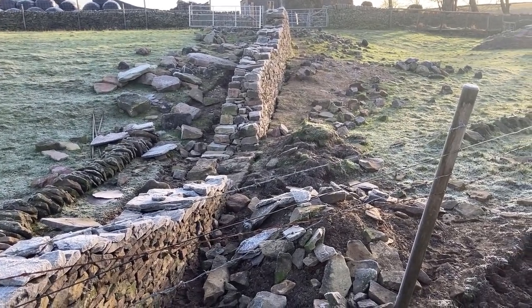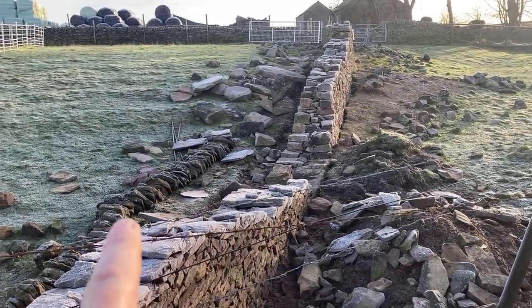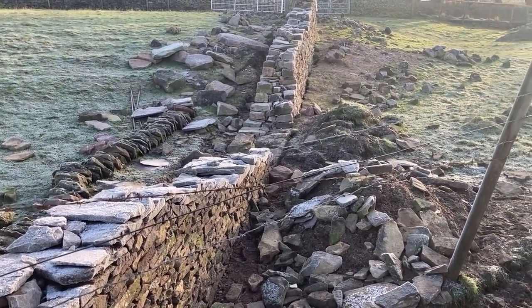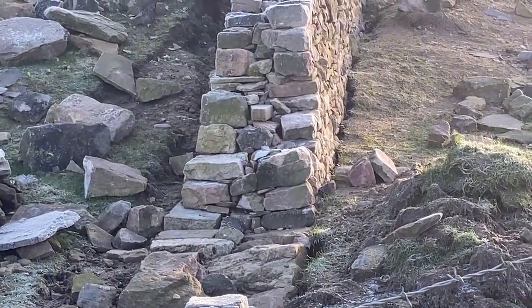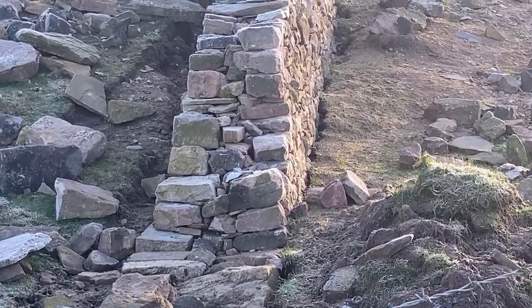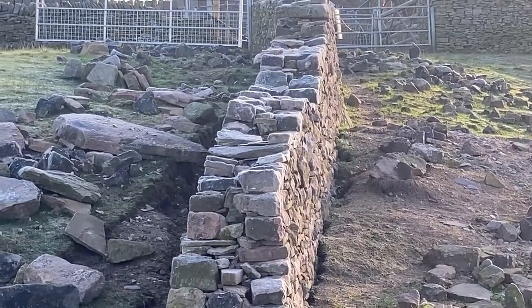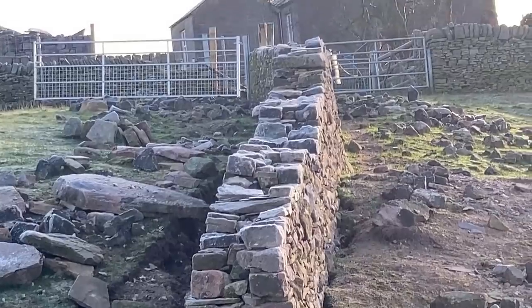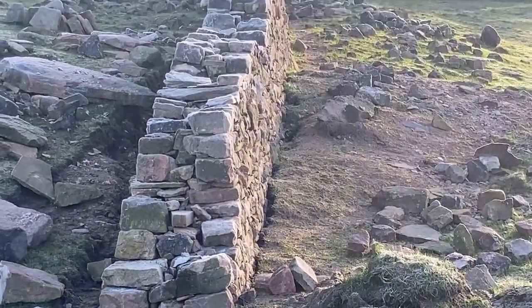That's probably a slightly better example of a dry stone wall being built. So you see the capping stones are laid on one side in a line, and they go back on top. And you can see the two outer skins and a rubble fill. And every few stones, they'll put a tie-in piece which cuts across. So, for example, let me get my mitt in there, that one, which is a tie. And you can see the taper on it though.